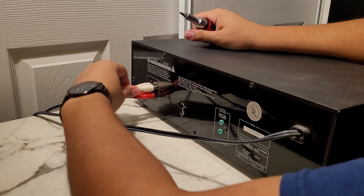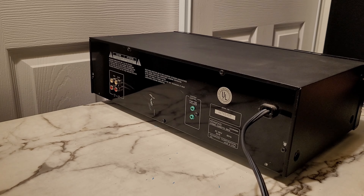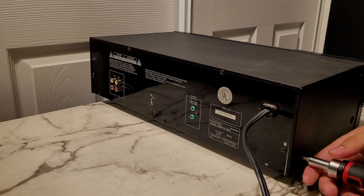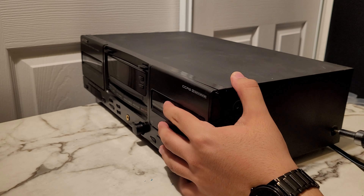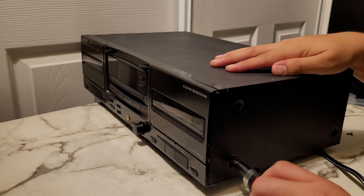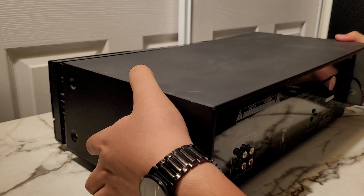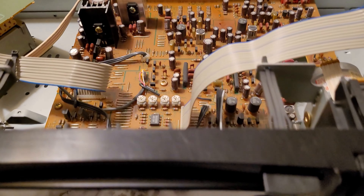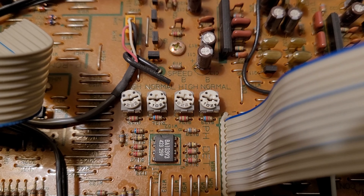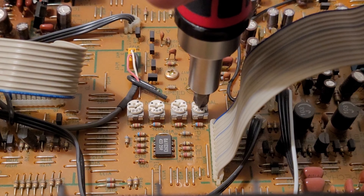I have a Kenwood KXW4060 tape deck which I got to match my Kenwood KR-V6060. The main draw for me was the dual tape decks and the ability to control it with my remote. It also fits right in with my CD player and helps my hi-fi have a unified look. Opening the tape deck is just a simple matter of taking out the screws holding the top down and removing it — it's a nice piece of metal that hides all of the tech inside. Once inside, I saw the screws for adjusting the speed for each tape deck. This machine can do normal and high-speed dubbing, so that's why there are four screws to adjust in total.